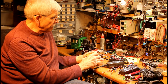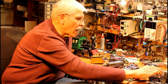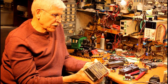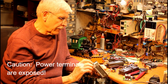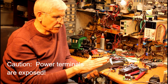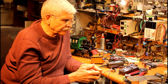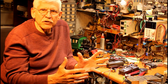There's one other option for power supplies. If you really want a lot of power, you can use this type — an open frame computer power supply. This one is from a company called Marlin P. Jones down in Florida. This is 24 volts at 4.2 amps, and it is really well built — it's going to last you a long time. I think I paid about $25 for that. If you get a power supply like this, you can build everything into one cabinet.